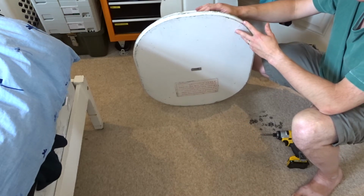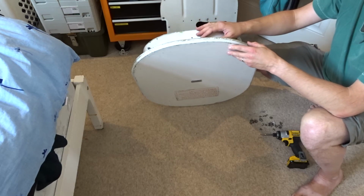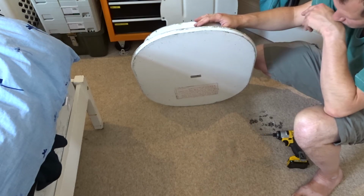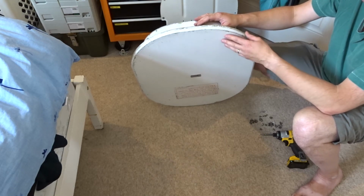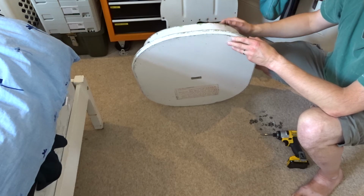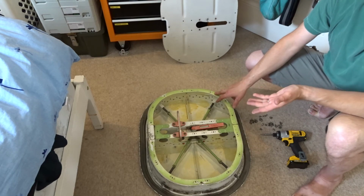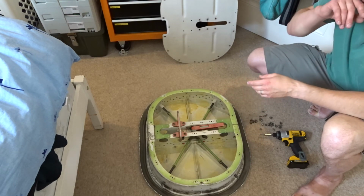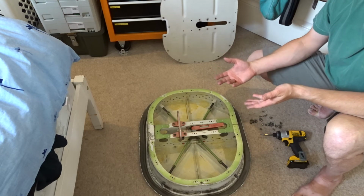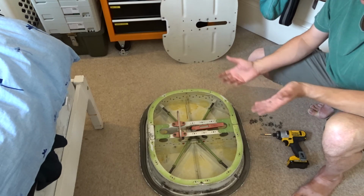The reason they used the chromium in it was originally back in, I believe, the 1940s, when they were trying out jet aircraft. They found that raindrops at a certain speed caused dents to the aluminium. So they put this chromium powder within the actual paint itself, which is very, very strong, and it made the paint resistant to hailstones, for instance, or raindrops. I know it seems very silly, but when you're taking an aircraft from say 200 to 300 miles an hour up to 1200 miles an hour, unfortunately a raindrop or a snowflake can actually cause damage to your aircraft. So that's why they've done that.